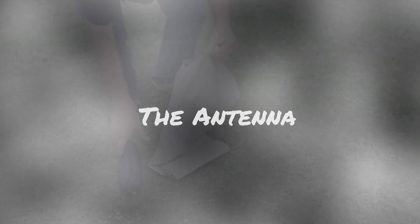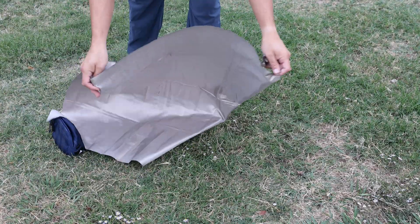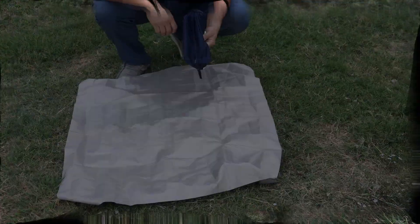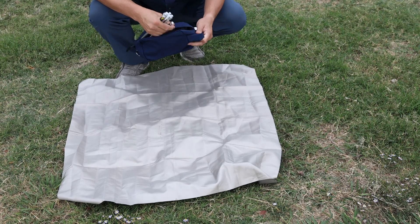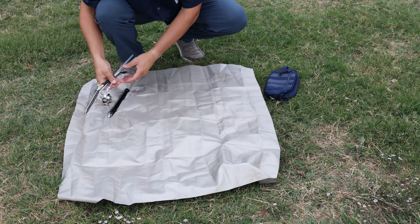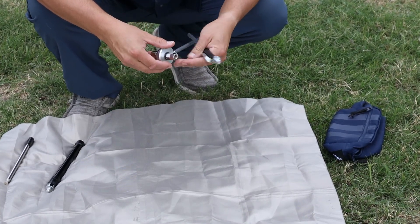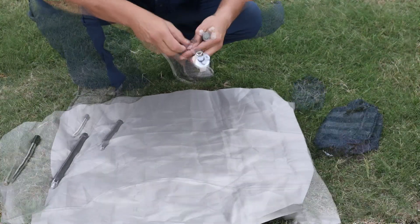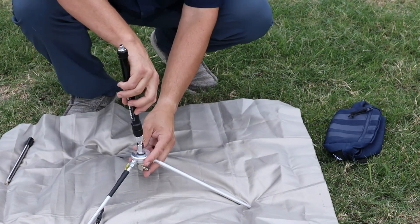This newest system I'm using uses a Faraday cloth, which is a 33 by 44 inch rectangle. This cloth is very lightweight and provides a good ground plane for this antenna. The antenna we're using today is a gable antenna and a Wolf River coil tripod. I honestly wouldn't have used this tripod with a Wolf River coil system just because it is not very wide, and that Wolf River coil has a pretty good height to it, so it tips over fairly easily.